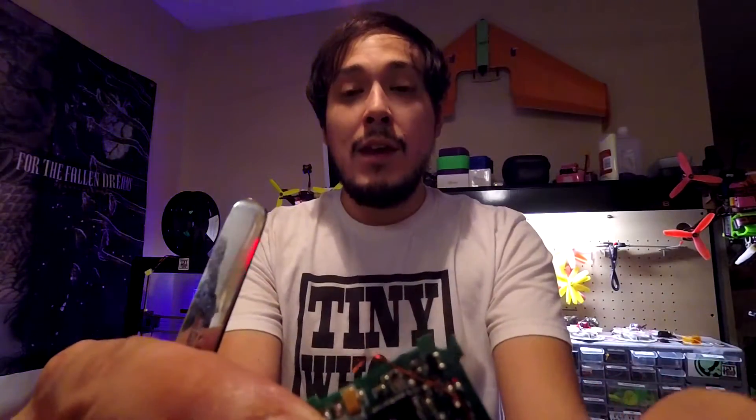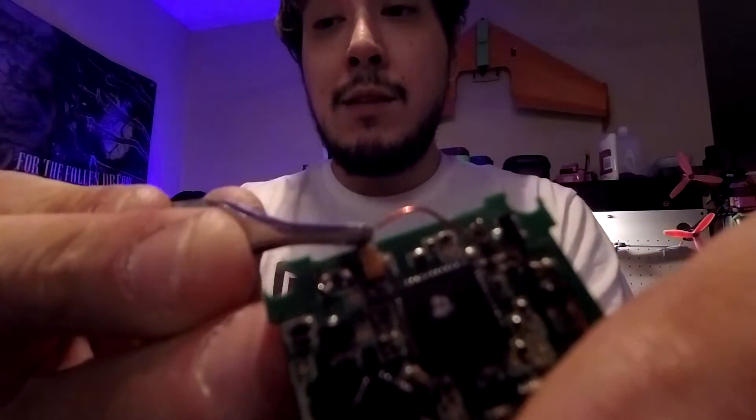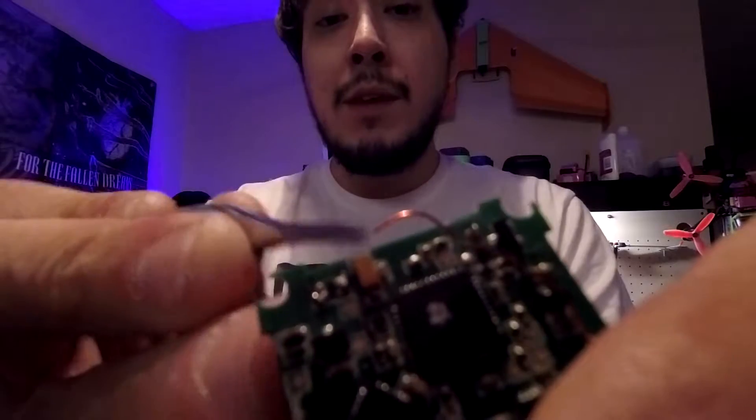This week I've been getting a lot of emails about people accidentally applying reverse polarity to their TinyWhoop board, their stock boards. What happens is it burns up the board and makes it not usable, but I think I found a fix for it. When you apply reverse polarity, this yellow chip burns up. We're going to go over to the bench and I'm going to show you how to fix this and where you can find these chips. You can order them off eBay or from a couple other online places from China for really cheap — like $3 for 20 of them.